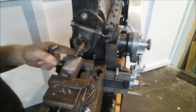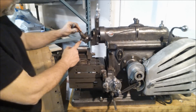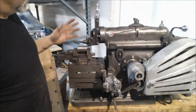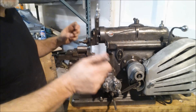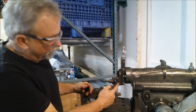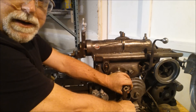The cutting tool does have a radius on it. You can put a lathe tool holder in the lantern tool post, just like in a lathe, but the problem I've run across with that is it tends to chatter more. You get a really nice cut if you reduce the amount of overhang - take that out, reduce the number of degrees of freedom where the tool might have some movement. Tighten everything up, reduce the overhang so you don't have the slide a long ways away from the base. If you do those things it'll tighten up and you'll have no chatter, and this showed no chatter, so it's really working great.